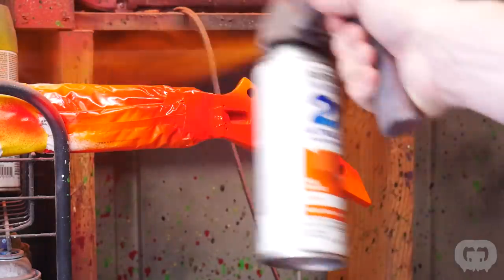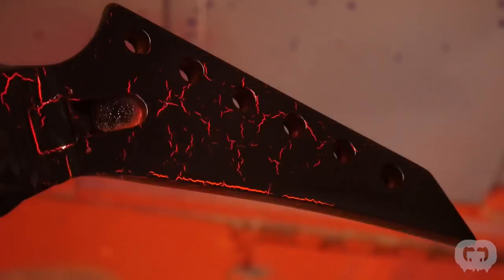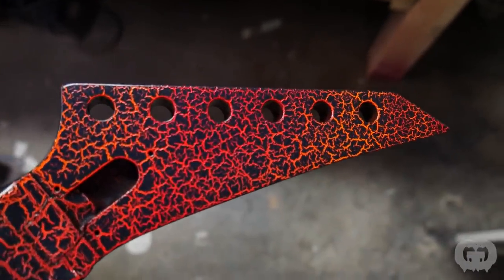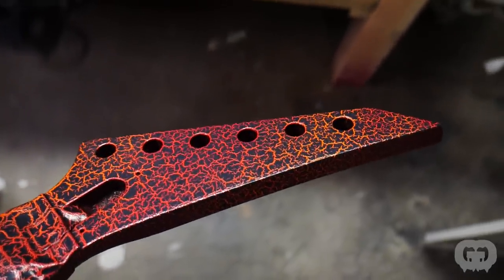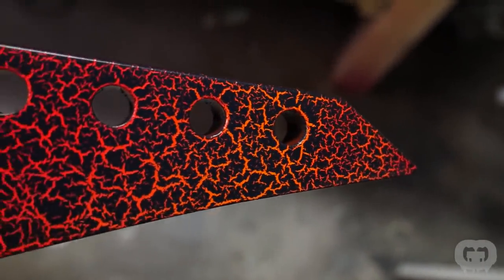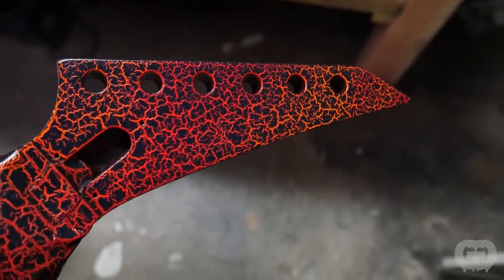This clear coat I had used was a polyester clear coat, which is incredibly durable and hard. So to sand back through all this I had to use 80-grit sandpaper, then 320, and finished it off with some 600. When I painted the body, I also painted the headstock to match — there's nothing like a matched headstock with a new custom logo. On goes the crackle paint and, like magic, it does its thing. Turned out super awesome, so I won't need to repaint the headstock like I will with the body. Did I achieve the cracked lava look? I love the burst on this headstock, the orange and red — nailed it in my opinion. I'll take the small victory of the headstock working out even though the body didn't.